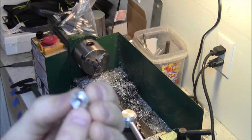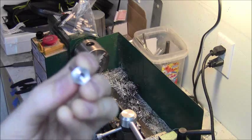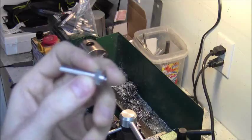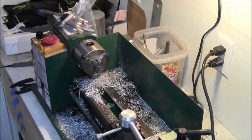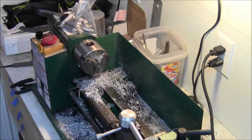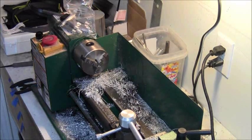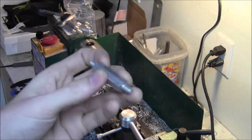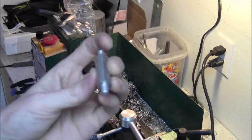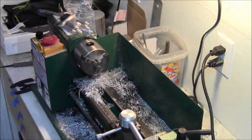I'm going to thread this hole with a number eight instead of a number ten because you can see this flange is very thin. I've already popped one of them off, so we'll make a new one and get it set up. We'll start turning some stuff on the lathe. I started using these little guys I got from Blue Collar — it's just a hex thing with a couple of threaded ends, I think quarter-inch ends. I'm going to try a couple of things today to see if I can make some more repeatable results.